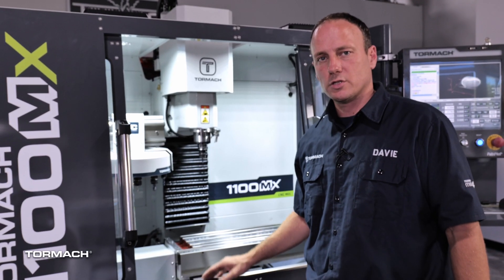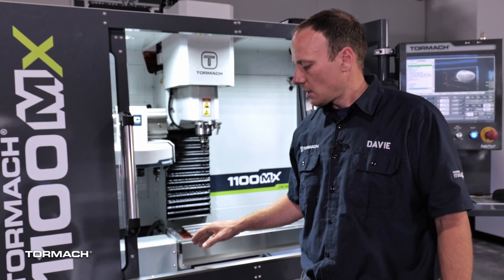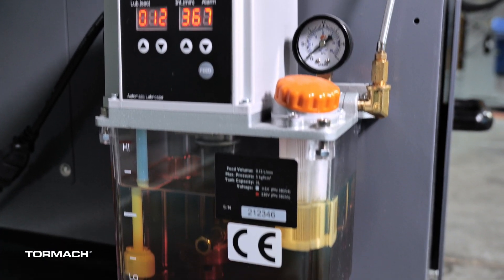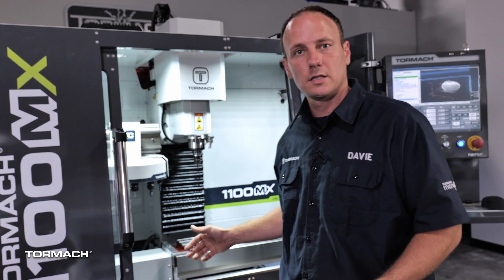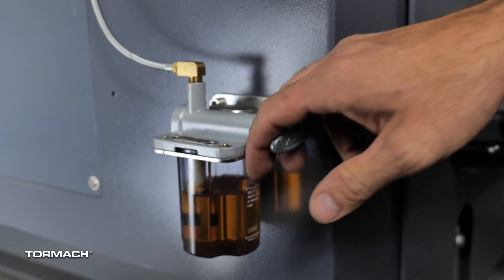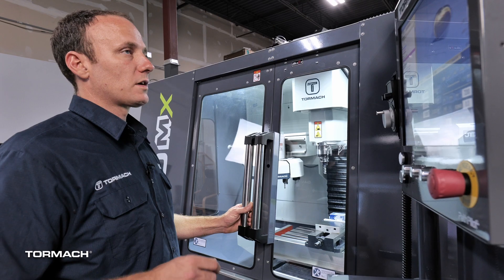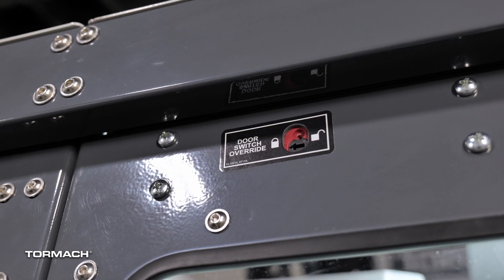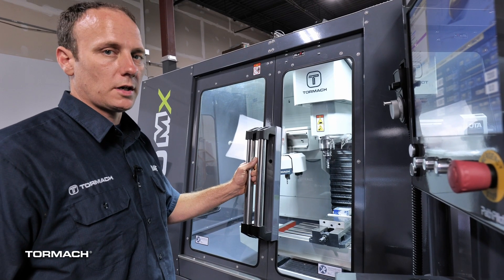One of the other things you'll want to pay attention to is the way oil for the machine. We offer an automatic oiler to handle that for you so it runs on a periodic basis to oil the dovetails and ways of both the X, Y, and the Z column. The other option is the manual oiler that comes default with the machine. These machines also have an optional safety feature which is a door lock switch kit, which keeps unwanted fingers out of your working envelope.